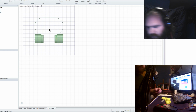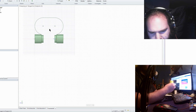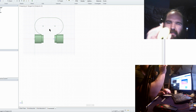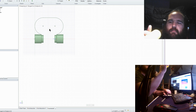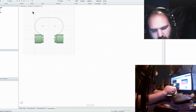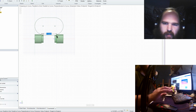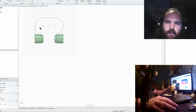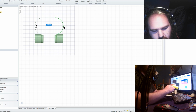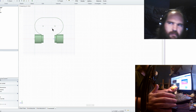You know what I can do? Being sensible, like doing things that are obvious and logical. If I put the original pump grip back together, how does it go that way around? I can compare that shape to that shape. Yeah, I've got that right. Let's do some measurements just to be sure. It's got kind of 12 and a bit between here. I've ended up with 11.5. It's a little small. Here is 21.5, not 22.5. So it looks like I've made everything just that little bit tighter, which isn't necessarily a bad thing.